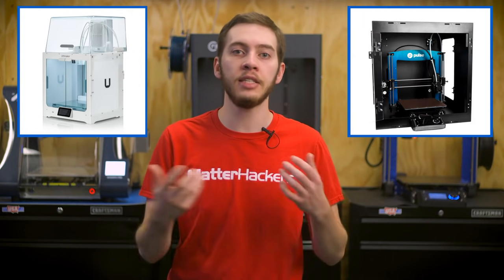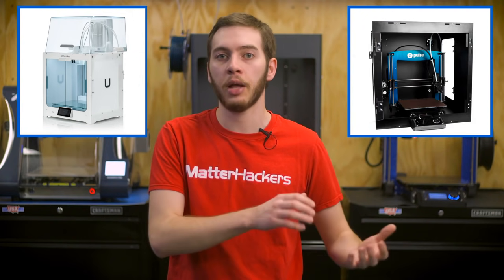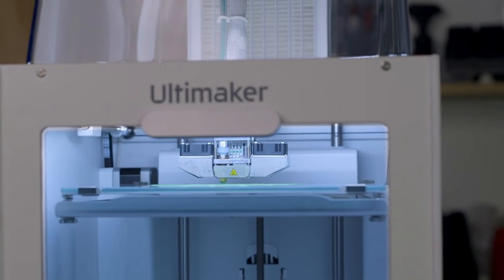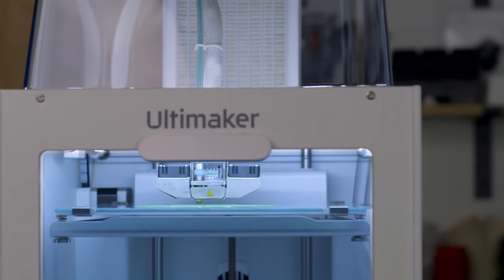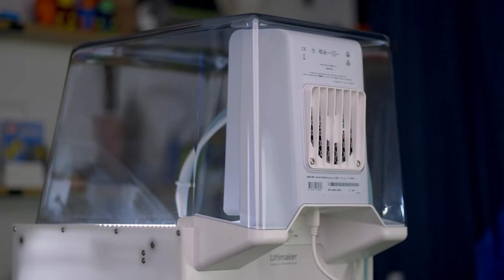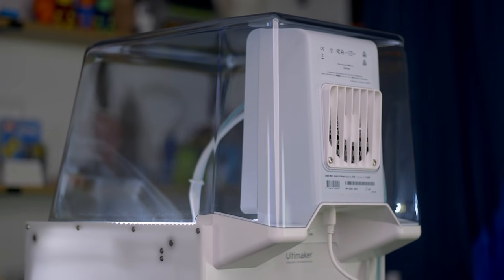Because so many of you felt it was an important upgrade, I want to give an honorable mention to enclosures. These are things you can either build or buy to encase your 3D printer and control the air within it by preventing drafty air inside. You can get something as advanced as the Air Manager for Ultimakers, or as simple as DIY flat-pack laser-cut panels to enclose a Pulse or Creality. These are especially useful when printing with advanced materials like ABS or polycarbonate, which are more sensitive to temperature and can split or warp without an enclosure.